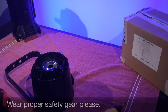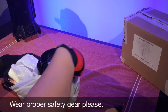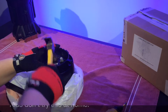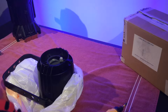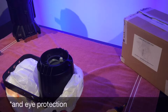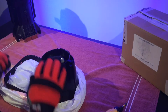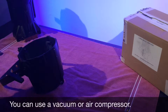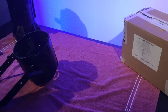We're going to take a plastic bag and put the back of the Source Four in the plastic bag like this. And since you're not going to need the reflector anymore — since we're replacing it with the conversion kit — this is what I do. This is why you wear safety gloves, because now you have a bit of glass to clean up. I just push all the pieces through there and now all the glass pieces are sitting nice and neat in the bag. Then I went outside and blew off any excess glass or dust that's inside of the housing. Now we're just going to set this aside.